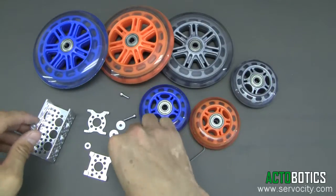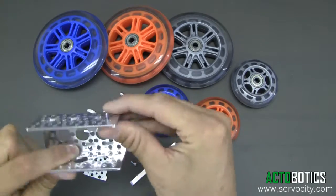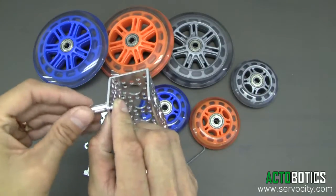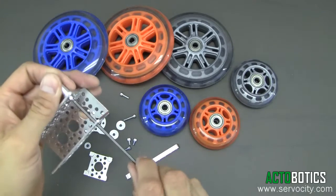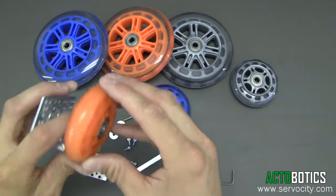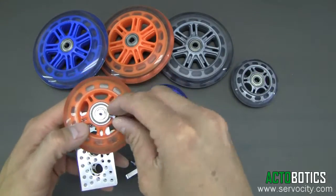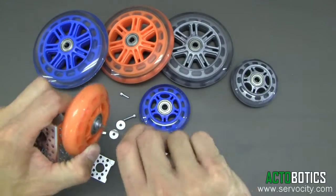One of the easiest ways to mount it — here's a piece of channel. You've got multiple holes you can choose from, so we're going to mount it up here at the top in the corner. Run it through. Both ends are tapped, and one end has a little lip on it that allows it to run on the race of the ball bearings. These are sold in a little kit along with a number six washer as well as a number 6-32 by quarter inch socket head cap screw. Tighten that on.